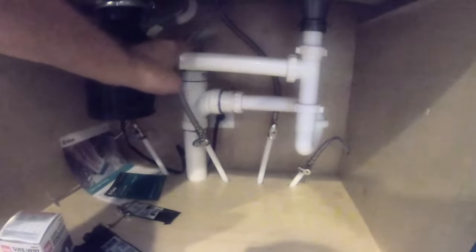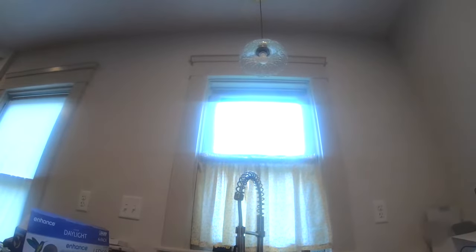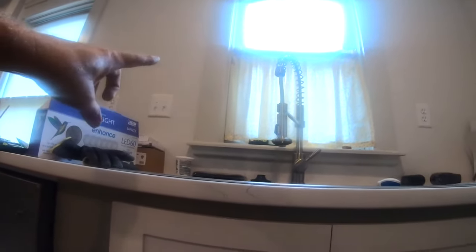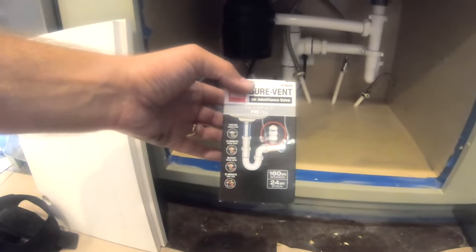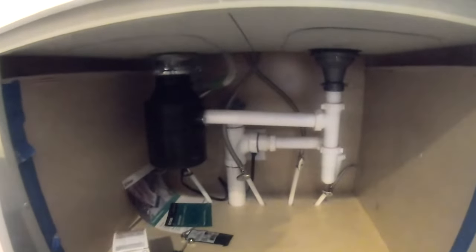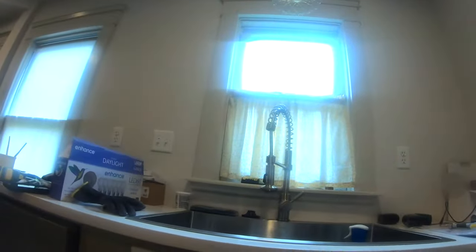To keep that water there, you have to have another way of air getting into this pipe — usually a vent that goes from there up through the wall and through the ceiling. But there's a story above us, with windows here and stud issues off to the side, so we decided to opt for this. You've got to check and see if this is code in your area. Plumbers who watch this are probably going to have something to say about it.